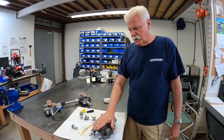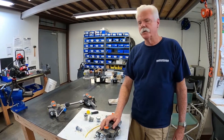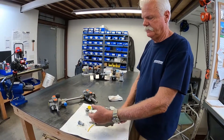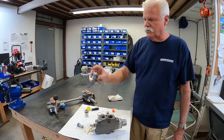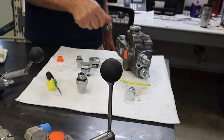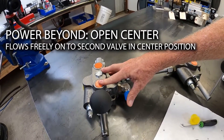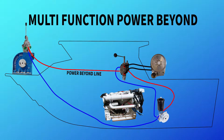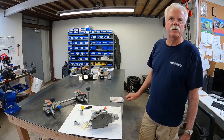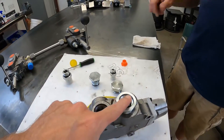If you wanted to incorporate this valve into a system where you had something you were trying to drive downstream, like an anchor winch, what you would do is convert this valve to power beyond — which is a matter of taking this plug out and installing this sleeve, converting this valve to power beyond like this one is set up. So envision this driving your pinch puller, the oil coming in here, out here, and this driving a second function on the boat — an anchor winch, a stern roller, a net reel, or whatever you have in mind. If you had an anchor winch that came from the factory with a directional control valve on it, it would connect to the power beyond port.